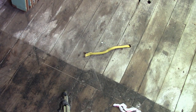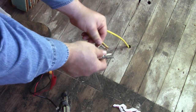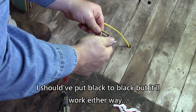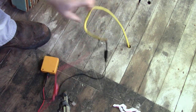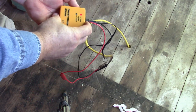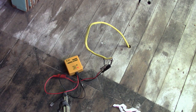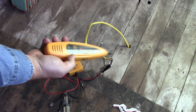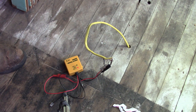Once you've confirmed your wires don't have any power, you want to make sure you've got copper showing. Put your black lead on the white wire and your red lead on the black wire — either way, I don't imagine it matters. Then turn the transmitter to tone mode. What it does is send a signal all the way down that line, and when you go to the breaker box with the receiver you'll hear the tone and it gets louder as you get closer.